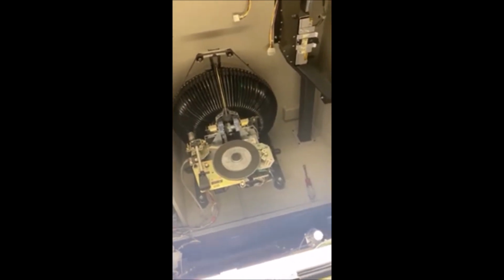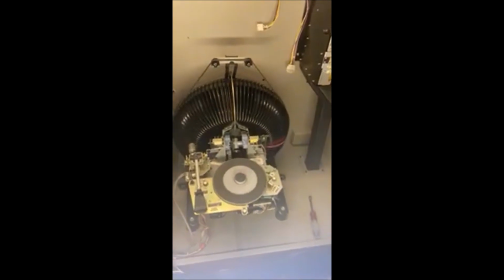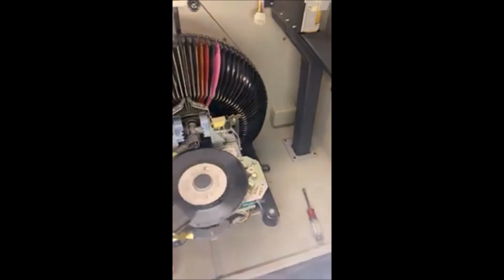What I'm gonna do is I'm gonna try to go in 1/4 turns of the carousel. So we'll do 125, 150, 175, and then 100. So it goes just past there. So there we hit 125, picks it up, puts it down. As you see, there's no slop in the carousel anymore. 150, right on target. No slop in there.